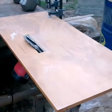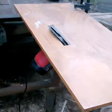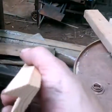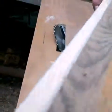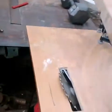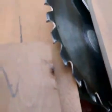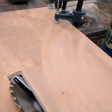He's crazy about woodwork. But I got this idea from him to mount the skill saw and make a makeshift table saw. But I finally got down to cutting this thing wide enough to where I could cut the 45 on that top edge. And of course, now it turns out, you can see I got this board, I did this with the skill saw already, that is not high enough to reach that top point. So I cut that all super wide for nothing, apparently. That's how wide it had to be to make that thing go all the way to 45. So now I'm going to have to take it back off, cut that groove, and then mount it back on. Hopefully I can get the straight cuts out of it.